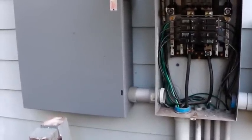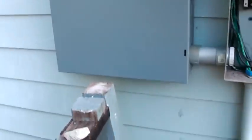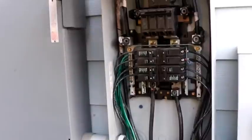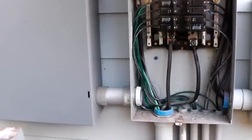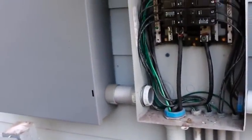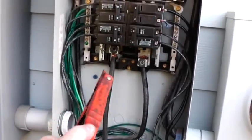I can't stress enough: always get a transfer switch. I got this one for free and refurbished it. A lot of people are cheap and throw caution to the wind, but if you back-feed this panel and power goes up on the line and you kill a lineman, that's on you. I always recommend you get a licensed master electrician, have the work permitted and inspected by code enforcement so it's done right — so you don't kill anybody or burn your house down. In an emergency you're going to see somebody come over and say they can hook up to the panel using jumper cables. Don't do anything like that.